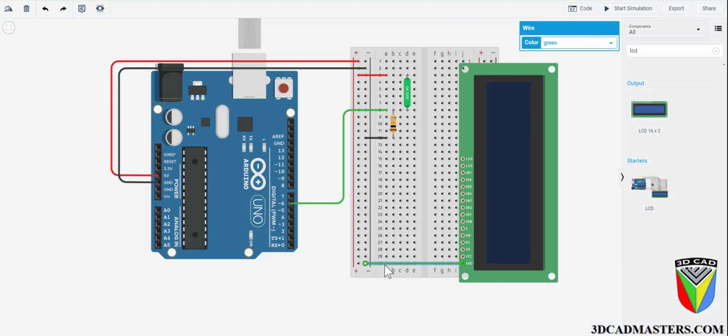I'm now preparing for the connection with our potentiometer, as well as attaching the LCD screen to the power and ground through red and black wires. The potentiometer will come in later during this video. I just want to make sure that I don't skip any pins or that I unnecessarily use a pin that's not supposed to be where it is.